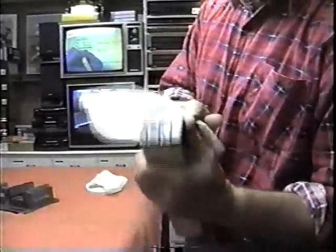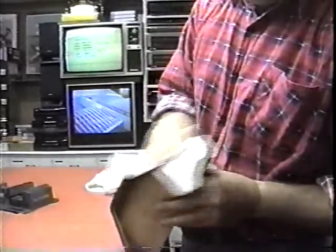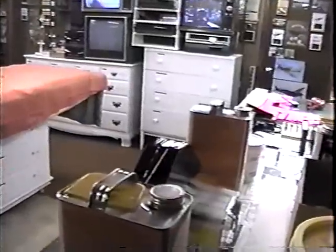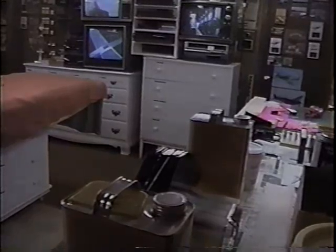Anyway, prepping these molds, this should be done on a regular basis, and I don't know how many parts. We've gotten about 30 parts out of these molds already. So probably every so often it needs to be stripped down. The reason I've gone to a black colored material is so I can pick up the flaws easier. The downside of using the clear was I couldn't see the flaws, and they would show up in the finished part. So we'll see how that wax release agent works with the PVA. Now we can work on Strega for a while.